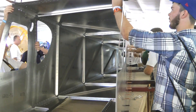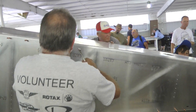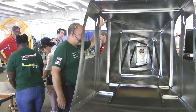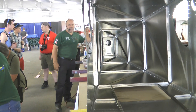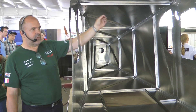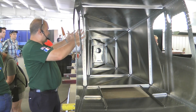We would start pulling some rivets after the clecos go in. We just pop a little baggage rack here to stabilize it, because the back end you'll see is nice and solid, and the front end is flippy-floppy. The airframe itself is solid at the back — no movement — but when I get up to here, it's flippy-floppy. So by putting the baggage rack in, we solidify the airframe, and we also stop anything going too far back in flight. Balance is really important, and you can't store bicycles back there — baggage has to go in a specific area.